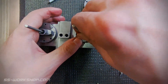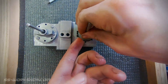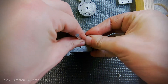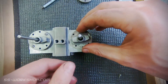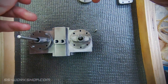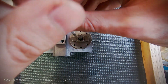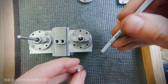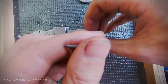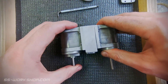Now back to installing the piston. This took a couple of goes but I finally got it in. I found getting one side in first was the trick. I found the piston cap needed to be installed before you move the piston, as this keeps the piston straight in the cylinder. The pistons freed up once they are well lubricated, but you can definitely tell the piston rings are doing their job as they're well planted against the cylinder walls.